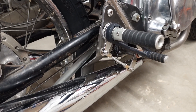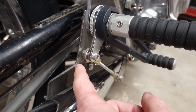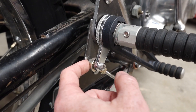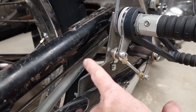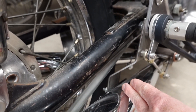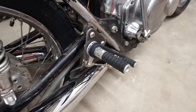I got the mufflers bolted back on. There's a little bit of a clearance issue with the linkage on the right-hand side, but it shouldn't be an issue in the end — I'm going to switch over to a set of clevis and clevis pins for each end instead of these heim joints, just to eliminate the nut and bolt as a potential point of failure. It took me quite a few tries to get this right, mainly because you've got two different angles — this is kind of parallel with the engine and frame but the exhaust isn't, so in order to get these two faces to line up with the components they need to bolt to, there are some weird angles.